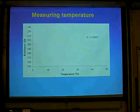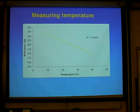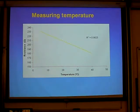This is a wonderful set of results from Richard. Richard's a third-year student who did a summer project for us. You'll notice the line's a little bit wobbly, and that's the problem with the lab as it was with the first years. It involves taking a piece of polypyrrole, sticking on it a bit of silicate, and putting it in some hot water, measuring the resistance and the temperature simultaneously. Crocodile clips make holes — they punch holes in the polypyrrole. So as the polymer moves, the resistance changes and you get fluctuations. Although it was a nice idea, we're going to have to look at how we actually attach the polypyrrole to the meter when we measure the resistance.